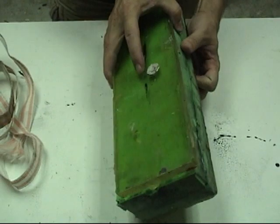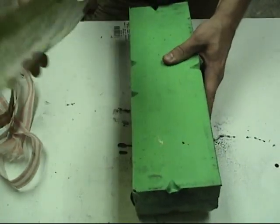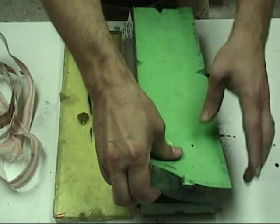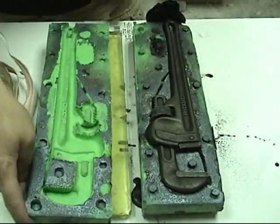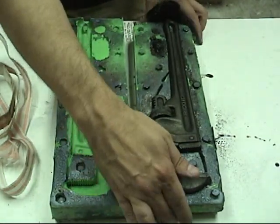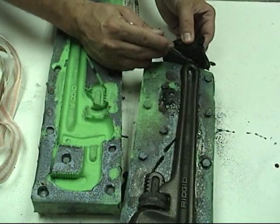The optimum temperature for working with flexible foam is around 75 to 85 degrees. Warmer temperatures will work, but hot climates speed up most materials and colder climates slow things down. Foams become much more temperamental in cold weather, so when in doubt, warm up your mold. If you're seeing skin issues, it's always a good idea to put a heat lamp over your mold to warm up the inside.